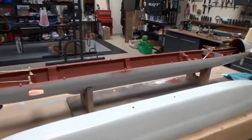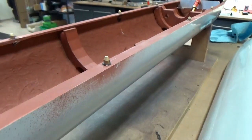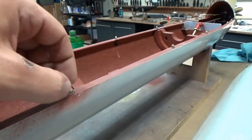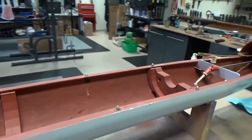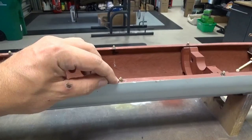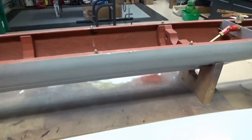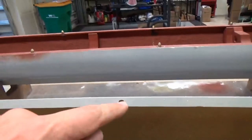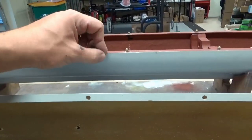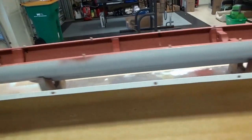Here's what we ended up with. These are solid brass rods with the tips ground down to a point, which helps orient the upper hull so they slip into their respective holes easily. I found I was off by about a millimeter or half a millimeter longitudinally in many cases, which isn't a big deal. I just took my Dremel and on the upper hull extended the holes forward and back — not left and right — to preserve the spacing.